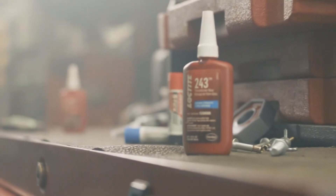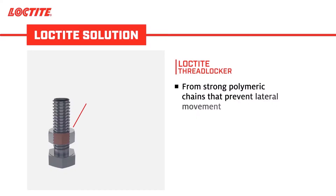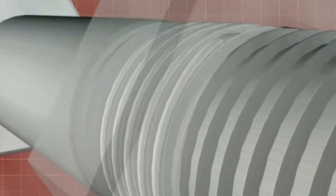People think of Loctite as being just purely a chemical thread locker to lock it — it's increasing or giving us maximum friction between the threads, and we do that by filling the gap. When we engage that nut onto the bolt, we're taking away the oxygen between the threads — metal to metal contact, absence of air — that will start the curing process and we will go from a liquid into a thermoset plastic within the set time for that particular product.